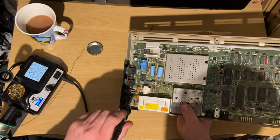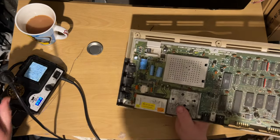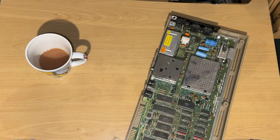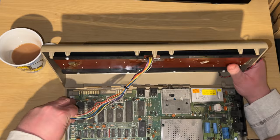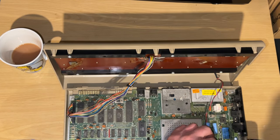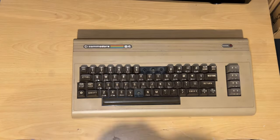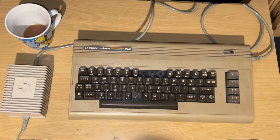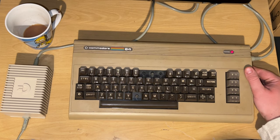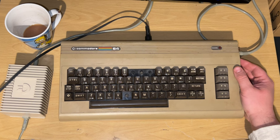Just examining the board making sure I've got all the solder off. First thing is just powering it up to see what it does - clear all leads out the way, get the lid back on, plug it back in. This is the first time I've powered it up since the mid-90s when I originally tried to do this repair. The power brick I know is good because it's the one I use with my other Commodore 64. Got the power light coming on.